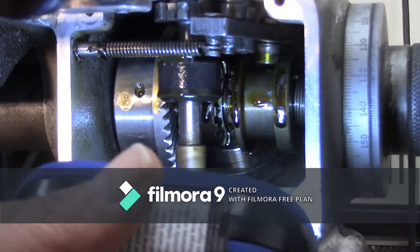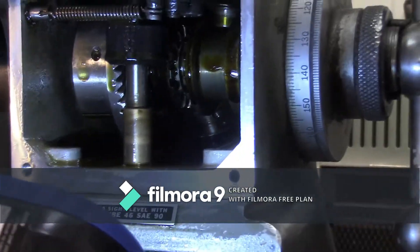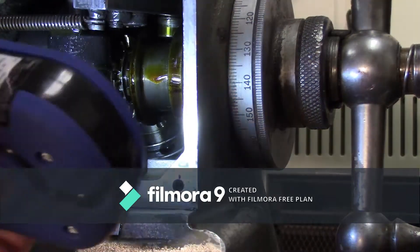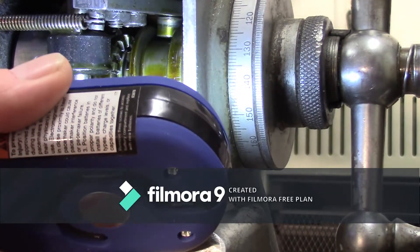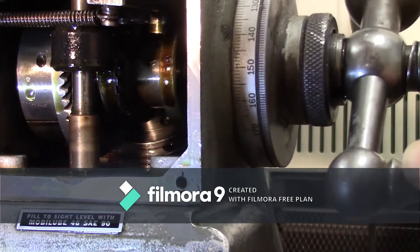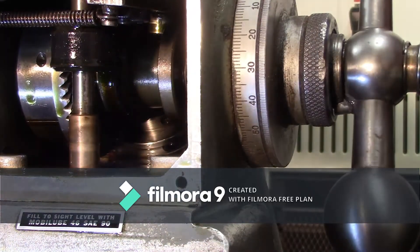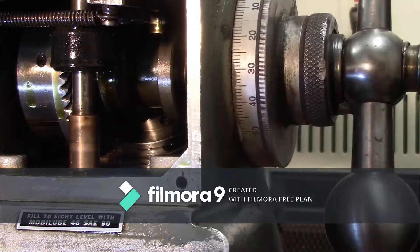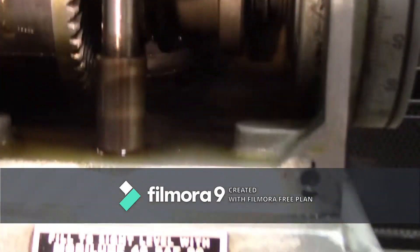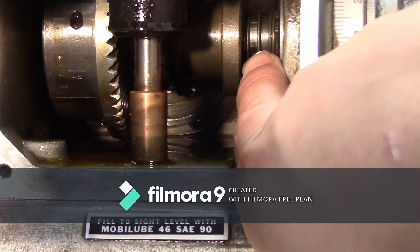I don't even know if you can see the little gears, but the gears — I don't know if this is even the right thing. The splines there — there's this gear that is motor driven, sure, but the splines here are what I'm concerned about. Now I'll put it in the other direction; of course it meshes perfectly, but sometimes the splines on this thing will slip, and I wonder if it's because this spring isn't as strong as it should be.